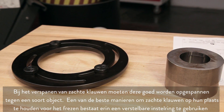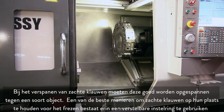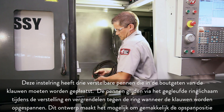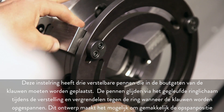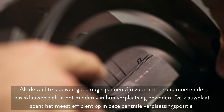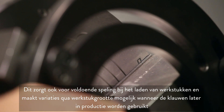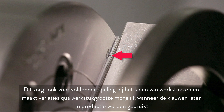When machining soft jaws, they must be clamped tightly against some type of object. One of the best ways to keep soft jaws in position for cutting is to use an adjustable boring ring. The boring ring has three adjustable dowels that are meant to be inserted into the jaw screw holes. These slide along the slotted ring body during adjustment and lock in place against the ring when the jaws are clamped. This design allows for slight changes in clamping position to be made easily. When the soft jaws are held tight for cutting, the master jaws should be at the middle of their travel. The chuck clamps most efficiently at this middle travel position, and it allows for adequate clearance when loading parts and for variations in workpiece size when the jaws are used later in production.